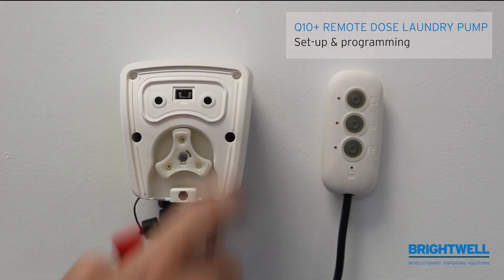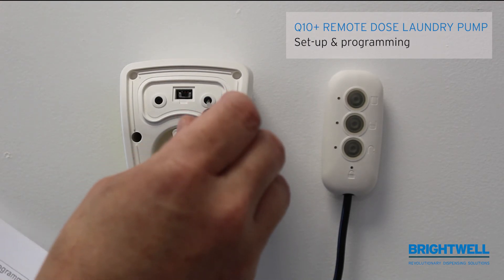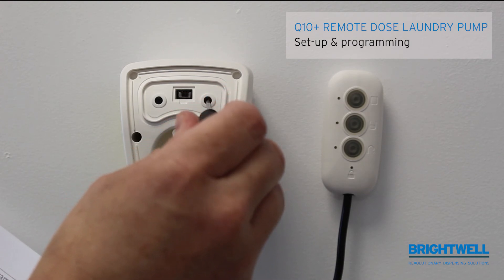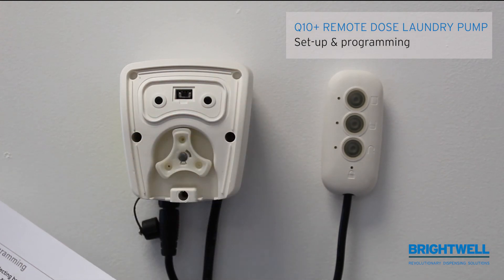Potentiometer B is used to adjust the lockout time. The lockout time is how long the unit has to wait after it has dosed before it can dose again. If the potentiometer is all the way to the left this indicates a two minute lockout time; all the way to the right gives a 60 minute lockout time. This means that if set all the way to the right, after dosing either the half dose or full dose, it will take 60 minutes before you can repeat the dosage again.